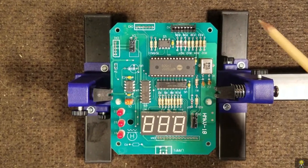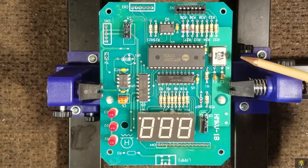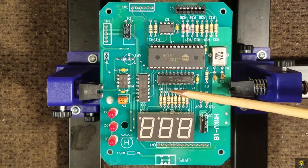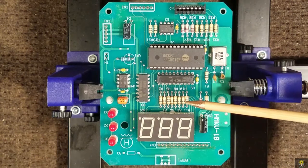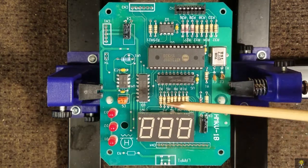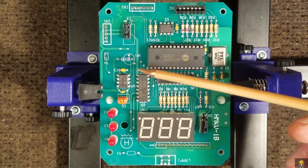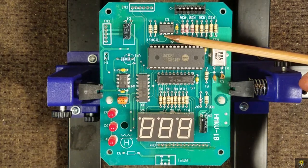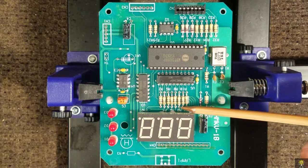When you initially examine a board, the thing you're looking for are the obvious standout items. Do we have exploded caps, burned up resistors, burned traces? These are the things that you start looking for on your first inspection. When nothing there becomes real obvious, you start looking closer at possibly solder joints. And looking at this, I'm seeing that there are an awful lot of solder joints here that are real iffy.